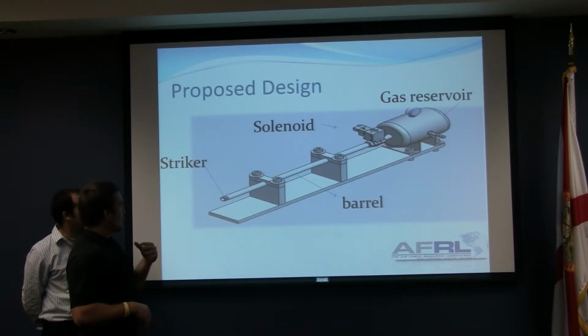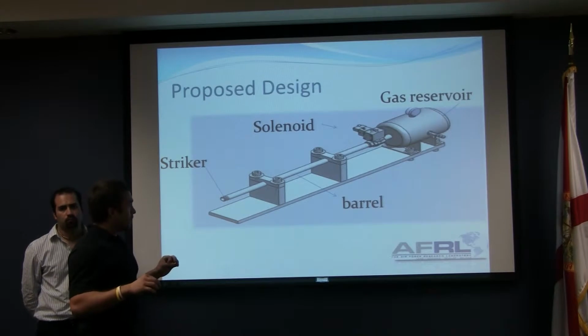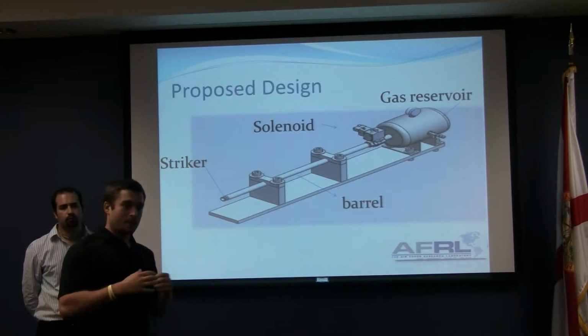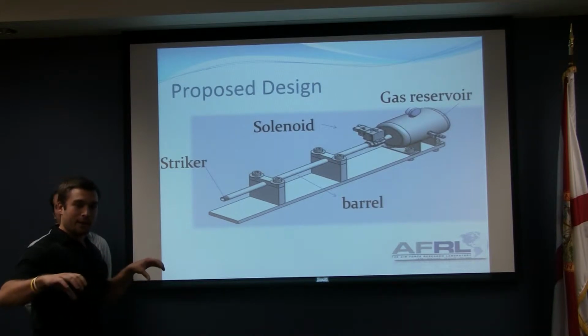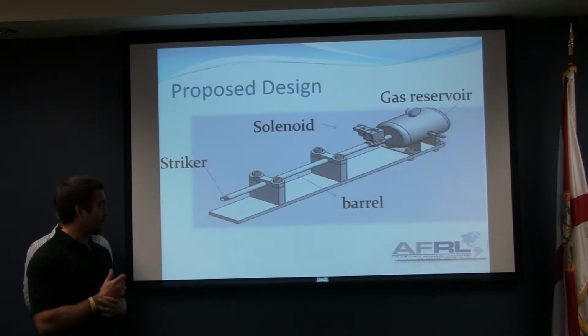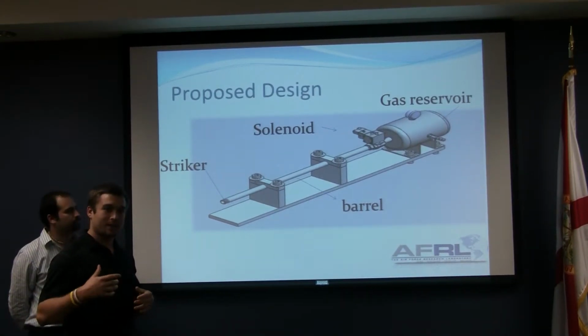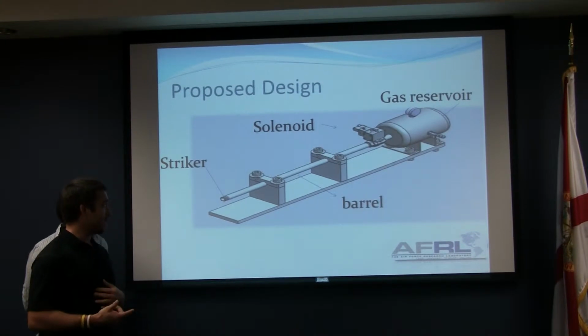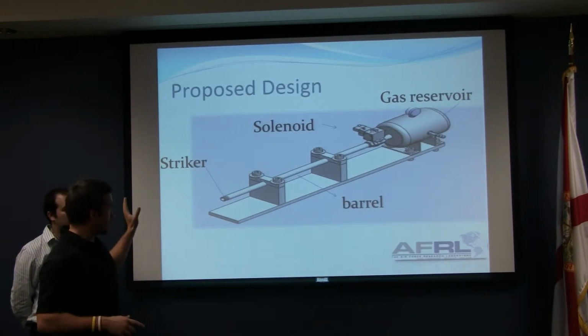What we did is we had the 1/2 inch steel rod wrapped with a piece of Delrin spacer, which encompassed the entire inner diameter of the pipe and allowed us to increase the mass flow through the barrel, and was able to give us the final velocity of 100 feet per second consistently. That is just the barrel design.